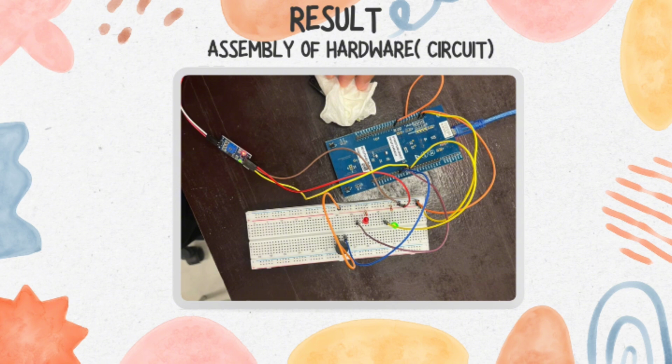The pin for the soil moisture sensor is connected to PA2, so later when we program it, we just name PA2 as soil moisture or soil moisture detector. Anything that can remind you will work. The same thing goes for the buzzer. The buzzer is connected to PA4. It's your choice which pin you want to connect to, but for this, it was easier for us to determine, so we connect it to PA4. The other side, the negative side of the buzzer, is connected to the ground.